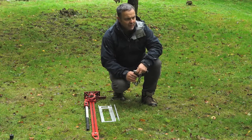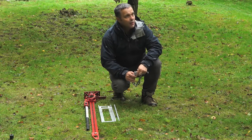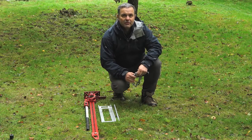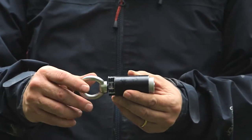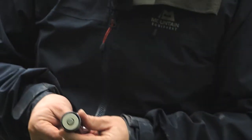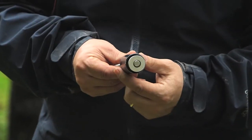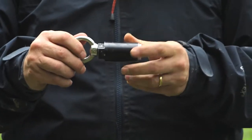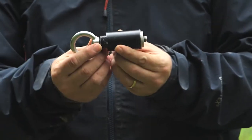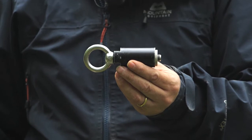So I think we should demonstrate how that fits together. We're currently in an old apple orchard. The experiments have finished so I need to remove the access tubes. So this is the clamp that connects around an access tube — the access tube actually fits in there. You push this in, then you tighten it up and it clamps onto your access tube. A very important part of withdrawing your access tube so that you can reuse them.